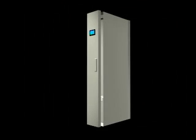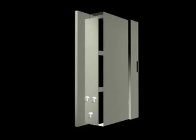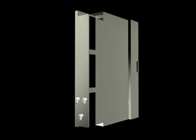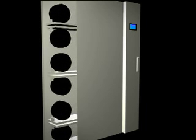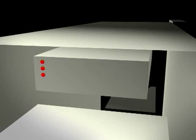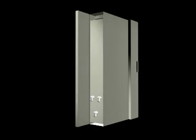The LCP Plus 300mm wide module consists of a heat exchanger fed from an external chiller system. Six fans circulate the hot air via the heat exchanger. Intelligent modules monitor the fans and the flow rates, and are displayed on a touch-sensitive LCD screen on the front of the LCP Plus.